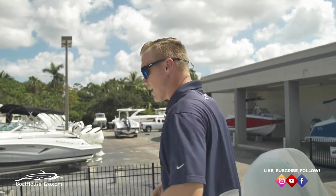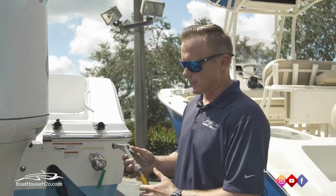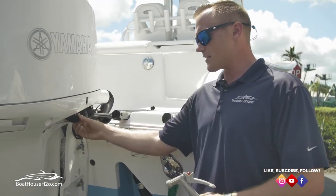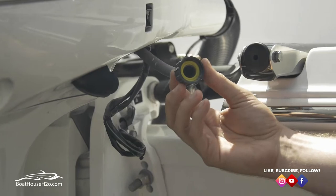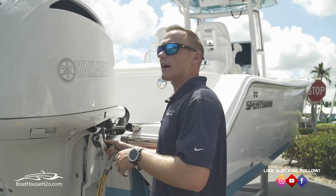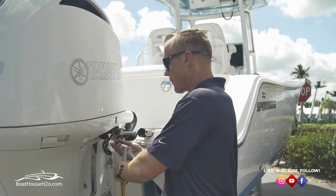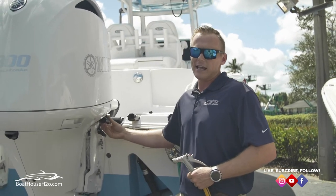On the Yamaha, this hose handle has a threaded tip, which is really nice because I don't have to turn the water off to hook up to my motors. The port is going to be right here on the side — all you do is unscrew this, screw your hose into it, then turn your water on and it'll rinse down through your system. I recommend letting it run for about 10 minutes per motor. It may seem like a long time, but by the time you're done emptying out your boat and bringing stuff up to the house, it goes by pretty quickly.